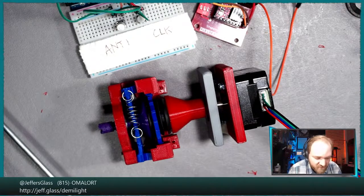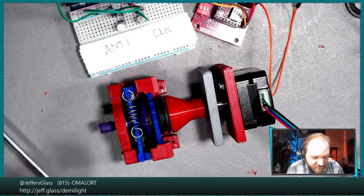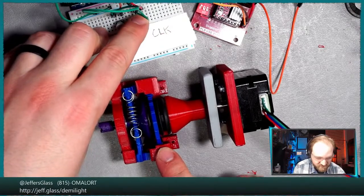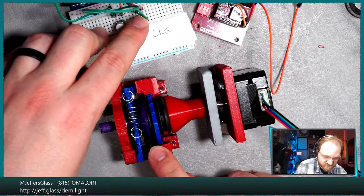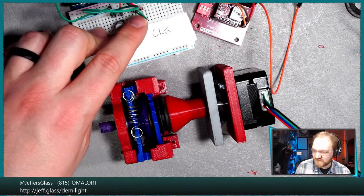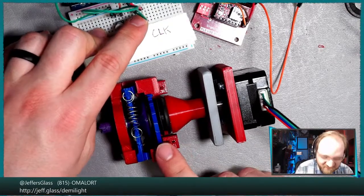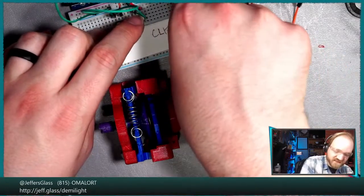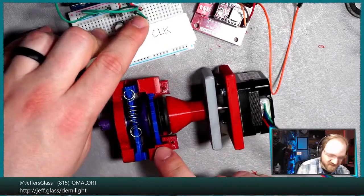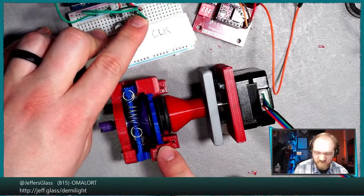So if we were to take switch full to 16th of a step, I think if this is low, then this becomes, oh, now, funnily enough, this seems like micro-stepping. I don't know if you can hear the change in here. Let me turn the music off for a second. Can you? I don't know how well you can hear the stepper motor through the microphone. But listen to the difference in tone between this and with all the switches in the alternate position. I think this was in full step mode. I think this has been in full step mode the whole time. Well, that doesn't make a whole lot of sense with our calculated rate of rotation. But I think that's microstep mode.